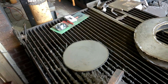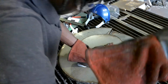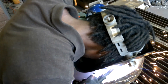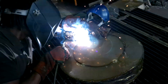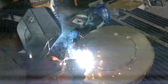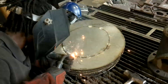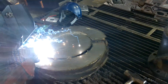I cut it out — this is two-ply again as well. I like to make everything two-ply when doing something this heavy. I start by tacking because when you do this type of welding, if you don't tack first, the heat will warp and distort the metal — it'll start going up and down doing wave dances. It's best to put a lot of pressure on it and tack it all the way around, then get to welding.